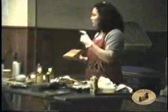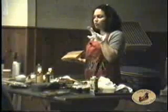What I do now is I cut back with my steel wool when it's dry, 4 hours from now, wherever I have any little imperfection on the surface. Steel wool is very important at this point because I want a mirror finish at the end. I wanted to bring a piece of French polish to see if you see your reflection. That's when you're going to be doing it right.